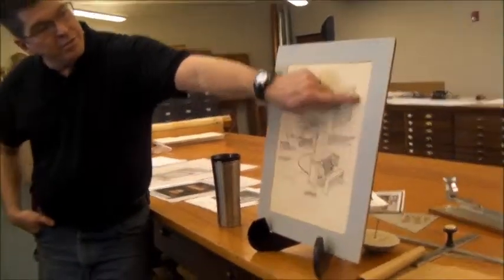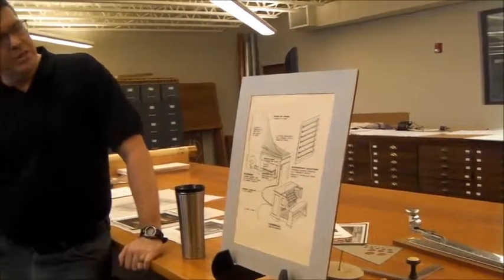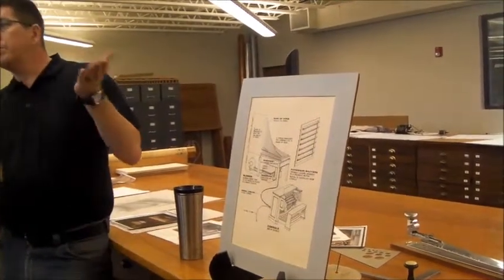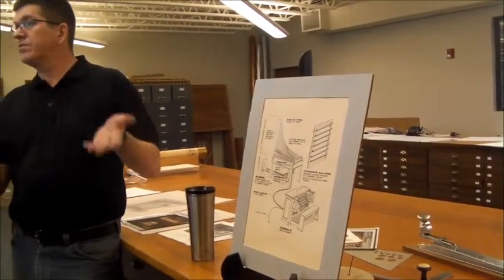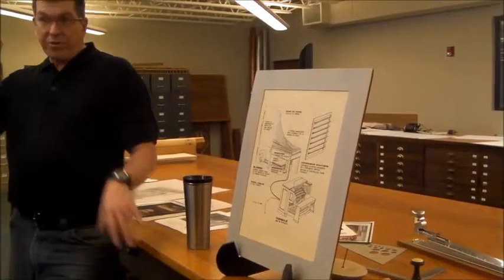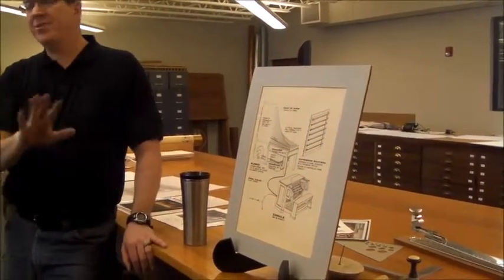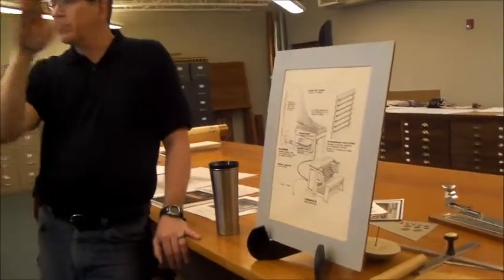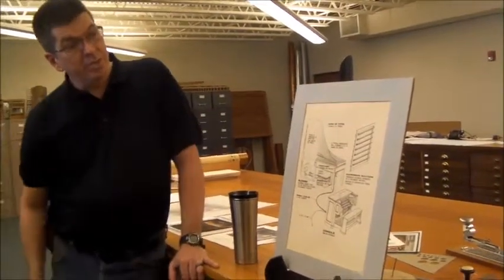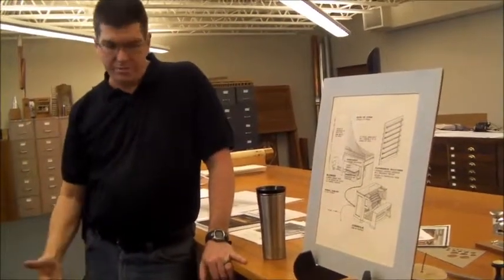And then we have this out front, which is kind of poorly depicted there, but basically it's a great big Venetian blind, and that's our volume control. Just like if you're in choir or band, if you want to get softer and you start letting your air off, your pitch dies out. Well, we can't do that with a pipe organ. We have to keep the air supply exactly the same. So we have that big louver out in front, that big shade, to open and close, and that's our volume control.